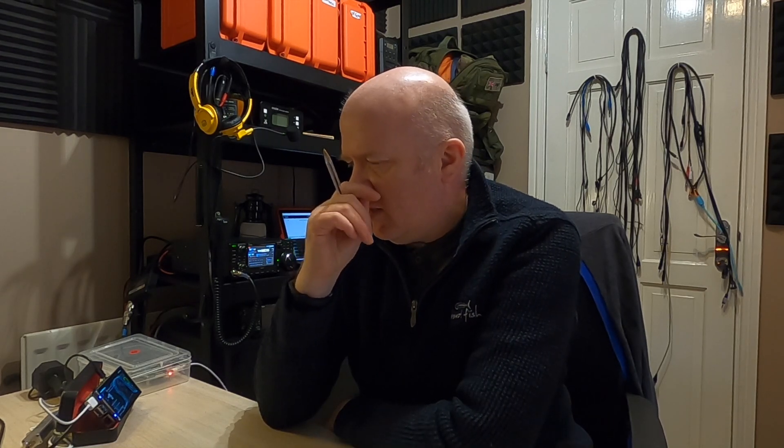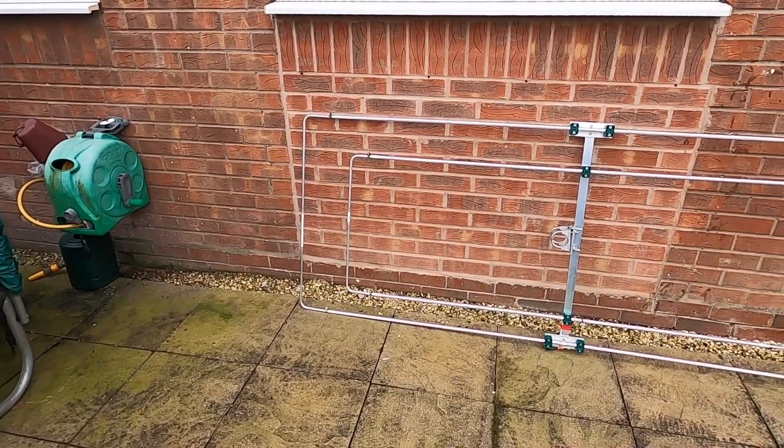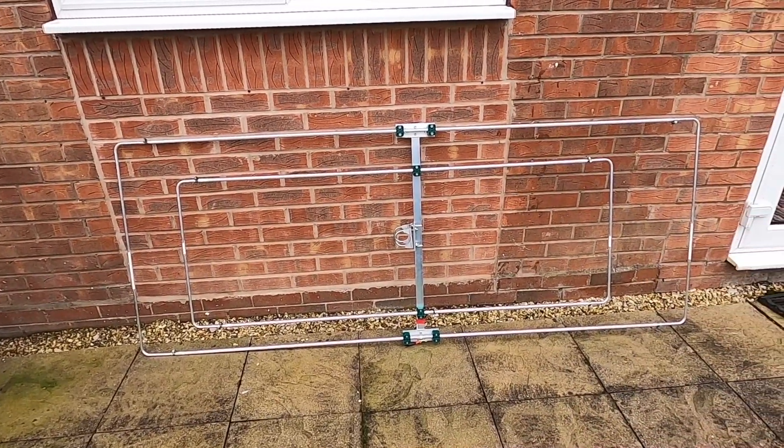JS8Call has helped keep me a little bit sane these past couple of weeks. I've also constructed a six-meter and four-meter Moxon antenna — I've had that up and running, it's tuned in, and I've had a few contacts. It's not quite the season yet and it was only up about three or four meters in the back garden, but I got a few local contacts into Wales and around the UK on six meters. During the summer I'll get it up for a few weeks and see what we can catch.